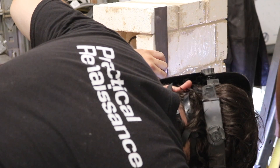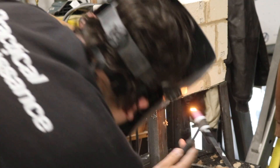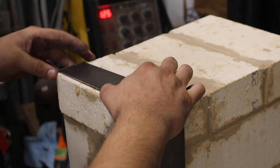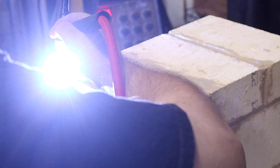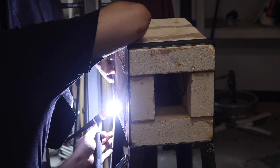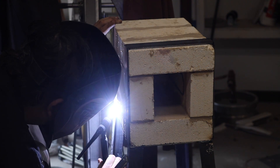I opted to build out the frame of this oven using two inch by one-eighth inch steel bar. Sheet metal may have been better — I just didn't want to store and handle all that sheet metal. This seems to work well enough for having a frame to hang off the control box, the door, and to keep everything generally safe and together.